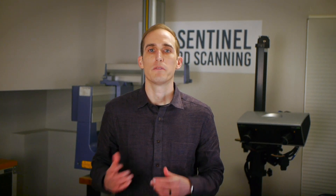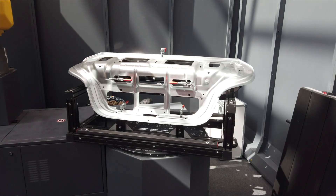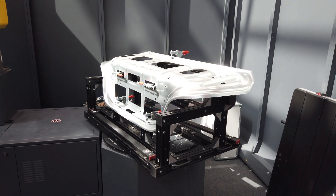Most equipment in your lab will need power, so make sure there are plenty of outlets and that they are evenly distributed. If necessary, have an electrician move or add additional outlets. Most metrology equipment only requires 120 volt power, but some machines need something higher — for instance, GOM's 3D scanning cells require 200 to 500 volts — so make sure to check what your equipment needs.